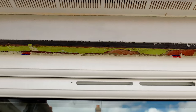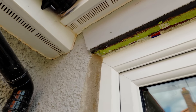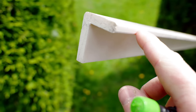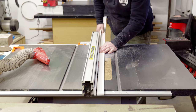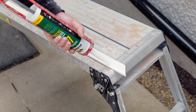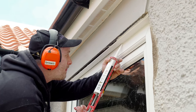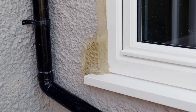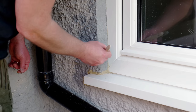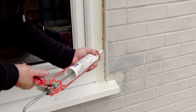For the top of this window I don't want to use mortar up here because I think it's going to be too awkward working upside down, and this is too big a gap to fill with silicone. So I'm going to have a look in my shed to see if I've got any plastic I can use to make a trim. I found some bits pulled out of a skip — a piece with a nice finished edge, so if I make a cut around here somewhere then I should have the perfect piece. This piece gets trimmed to fit and then I'm using a builder's silicone to fit it — this is specially designed for UPVC. Here's that deeper area and I used a weaker 5 to 1 mix for the top coat, which is why it's a bit more of a sandy colour. That should just help ensure that there's no cracking and I can get it all painted in. And then builder's silicone again to seal everything up.